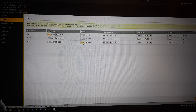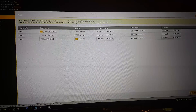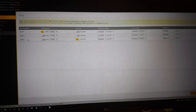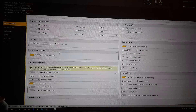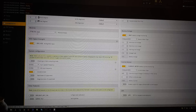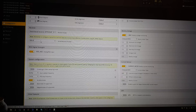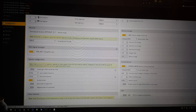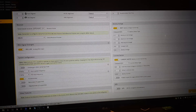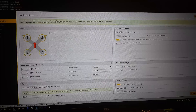In the Ports tab, don't enable the UART input — keep that disabled. Instead, enable Serial RX for UART3, then hit Save and Reboot. Next, go to the Configuration tab, scroll down to Receiver, select Serial Based Receiver, and choose SBus or IBus depending on your receiver. Hit Save and Reboot at the bottom right, and if your receiver is bound everything should work perfectly.